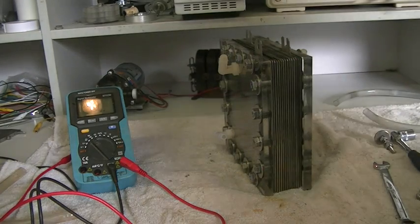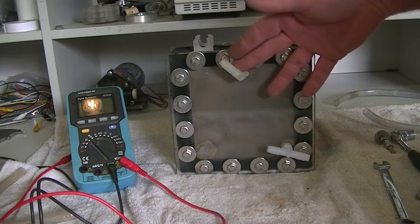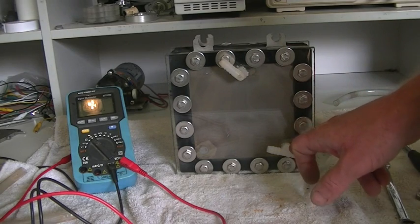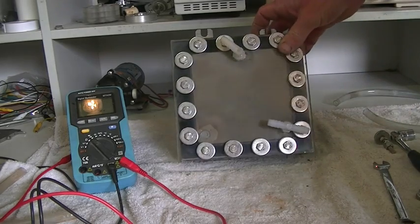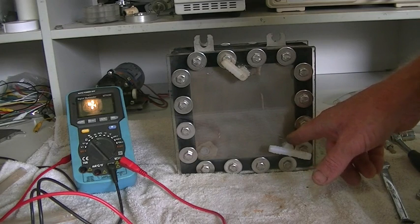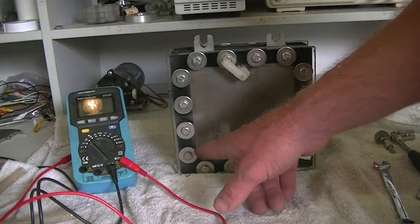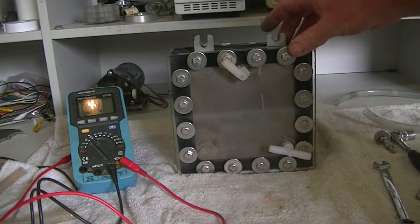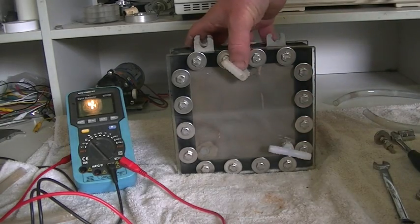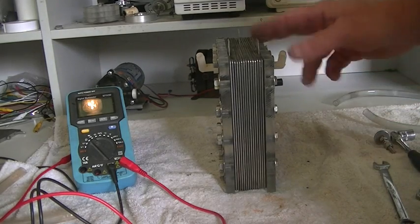We need to find what the problem is. Because this inlet is directly over a hole, we can safely assume it's not the problem. I'm hoping the problem is this: the gas inlet fitting has been screwed in too far and is too close to the plate, blocking the hole. The fluid goes in here, hits the plate, fills up that section, and should flow out through the hole into the next neutral section. I'm hoping it's screwed in too far, which is why there's not a good flow through that half of the cell.